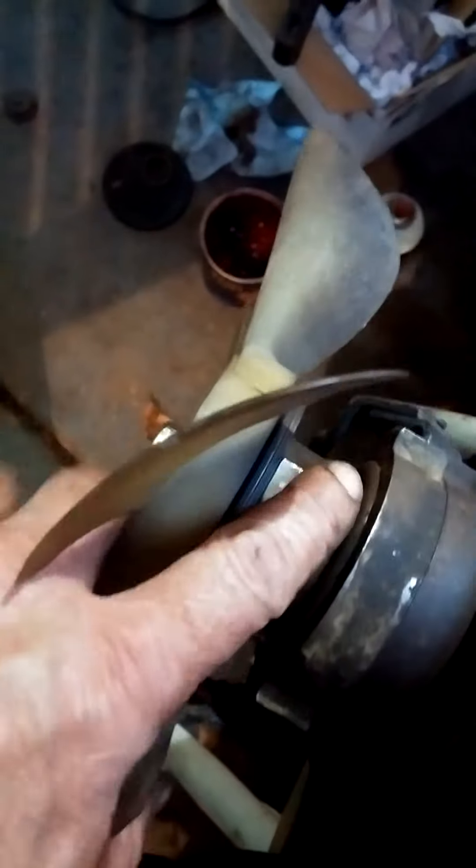What I did is I took and I spun this nut and I tightened this one here to spec. This is free and it's very close — it's like two thousandths away from the friction disc back down. It's like two thousandths away from the friction disc.